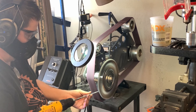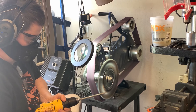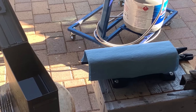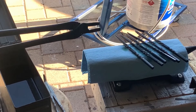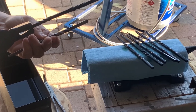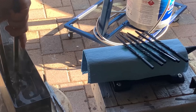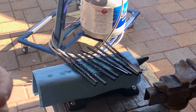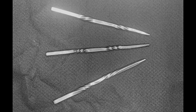This is the step that makes it possible to have an attractive finish of any kind. After that, it's under the wire wheel. You can see here I'm using the wire wheel to put a satin finish on the stainless. If I'm making a polished stainless, I'll go to a Scotch-Brite or a buffing compound. The last step is blackening the mild steel. The goal is for the linseed to bake into the metal — I go back to the forge, turn one burner off, and use the indirect heat to bring the stick up to temperature for a linseed dunk. The trick is to get a good even coat, a nice boil each time, and sometimes it takes multiple heats and a little steel wool. Once it's baked in, it creates a very shiny polymer effect that will protect the stick for many years. I have to apologize — my video work here isn't the greatest, but you can see the shiny part shows up real well.